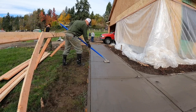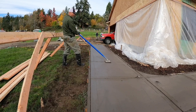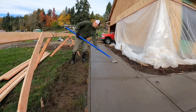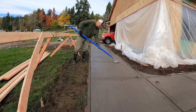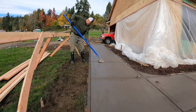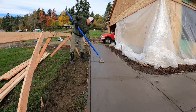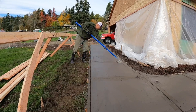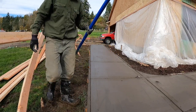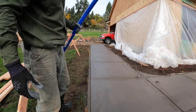These joints are about four feet apart — it's a four-foot-wide sidewalk. I did them all equal so I don't have some weird joint at the end. They worked out to be about four foot four. This pour over here — the truck was an hour and a half late. If we didn't have as many people working on it as we do, we could have probably lost it. But we're going to be fine, just a little harder work.